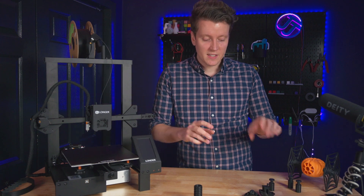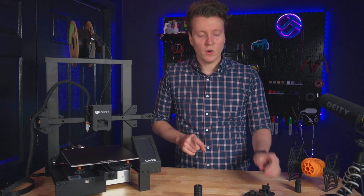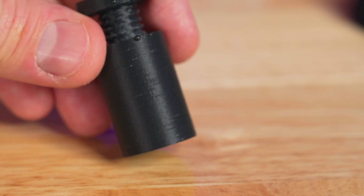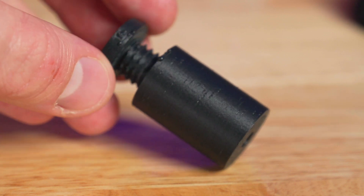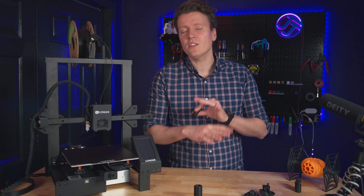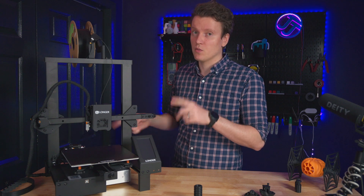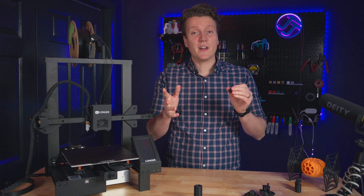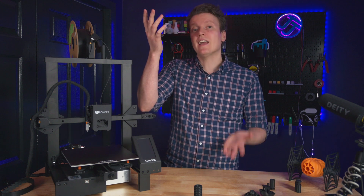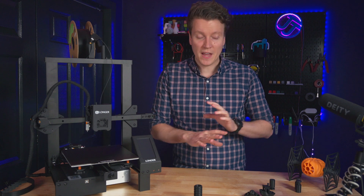Now that you know this printer has all the amazing specs and can print really well, what are the downsides? There are two big downsides. First is print speed — it struggles at high speeds. I got all of these little blobs and zits when it tries to do a retraction travel move, and it seems to make a really large Z seam on prints when printing at higher than stock speeds. I've tried everything to remove those defects. I'll contact Longer to see if they have any solutions. It's not a speed demon — it prints fairly slow but delivers reliable prints. At stock speeds, I haven't had a failed print at all.